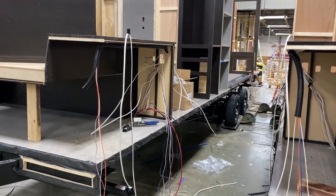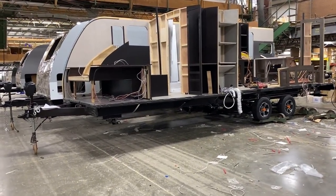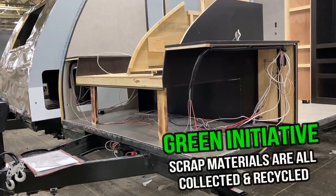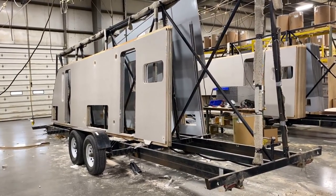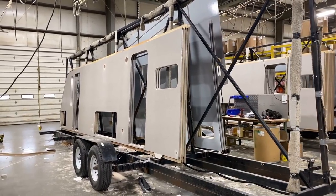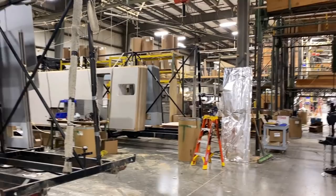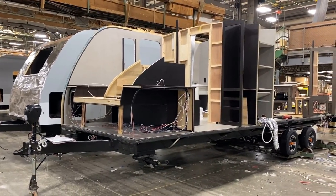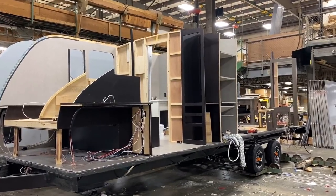This is a much easier time to run wiring and plumbing. You'll see small chunks of wire clippings on the floor — that's excess after pulling through to wire a light fixture, which gets cleaned up at the next station. Jayco has one centralized lamination facility where they do all their vacuum laminating. Manufacturers like to batch-build things — you get quality through repetition. It's easier to plan, schedule, buy the right number of parts, and for workers to remember which model they're working on.